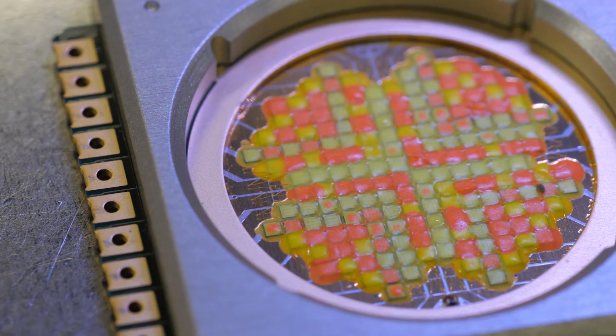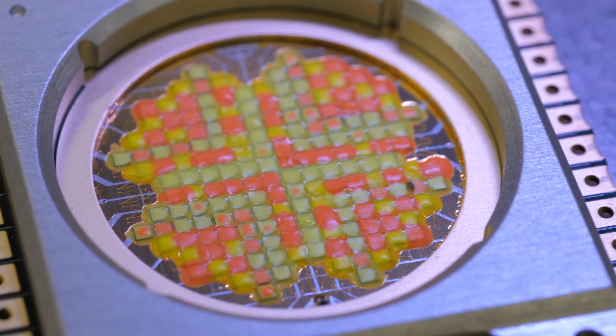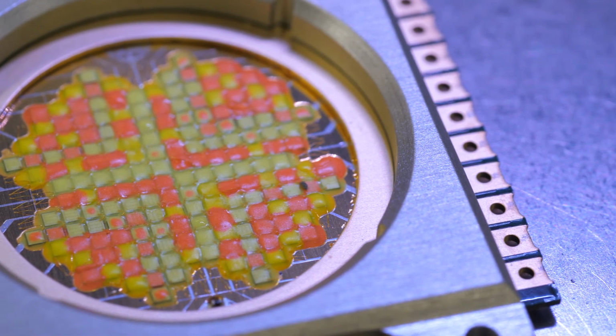After all this effort in designing the Fresnels and optimizing the array, what we end up getting is a really wide zoom range that goes from flood all the way to spot. And more importantly, throughout that entire range, our spot is well defined, it's smooth, and the color mixing is good everywhere in that range.